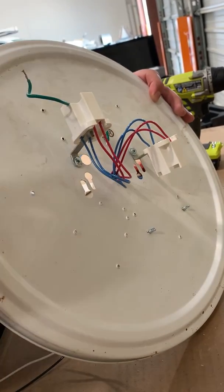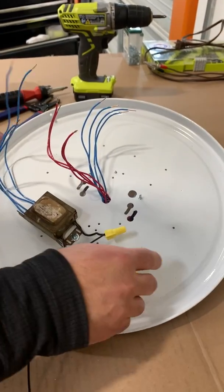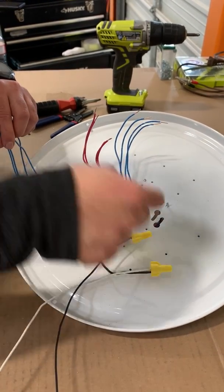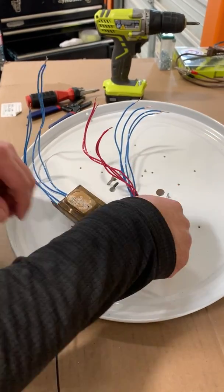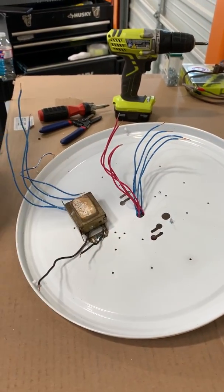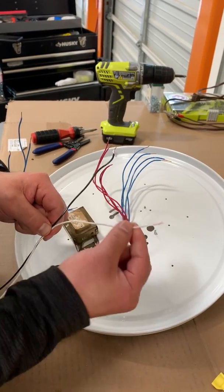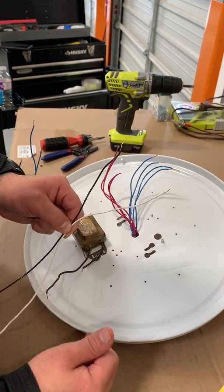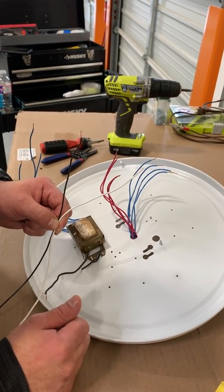Make sure that these are separate when you're wiring them up to the incoming voltage. I've color-coded them so you can see first-hand the way I'm going to wire this up. On your existing ballast, you're also going to have coming off of it your hot and neutral wire — your 120 voltage coming into the fixture. You're going to cut those off as well. Now I've totally eliminated the ballast from the fixture. This is going to be my line voltage coming in. Your neutral wire is always white; your hot wire — your 120 volt wire — is always black, red, or blue.